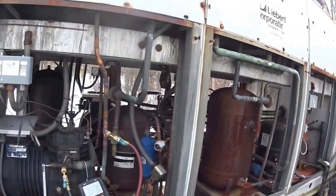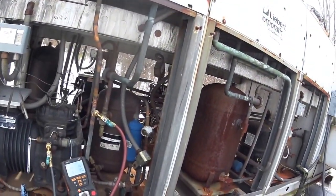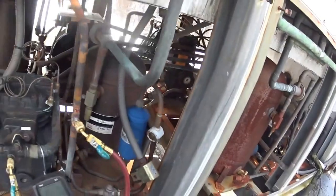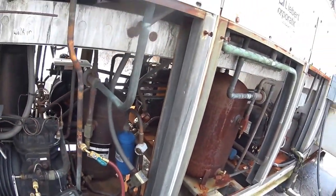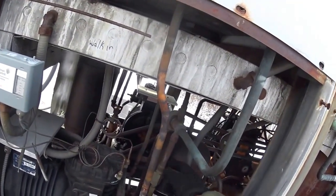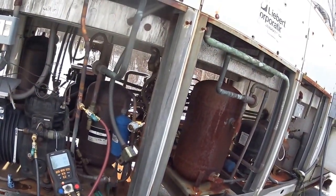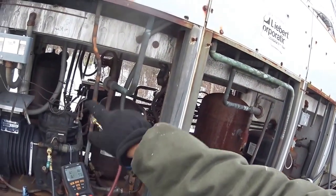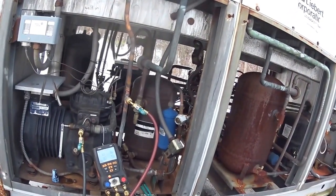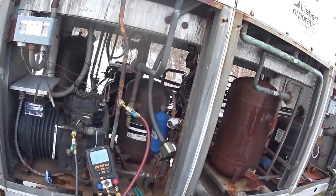We're filling up a little bit better now. I don't want to make it perfectly full, because you can literally overcharge it by a whole 24 pounds. I've taken a whole 24 pounds out of a system in early summertime because the technician put too much gas in it in the wintertime. What will happen if it's overcharged is the suction line will be frosting back to the compressor and my head pressures will be too high. When the pressure is low like that, you're going to bypass too much of the hot gas, taking away from the capacity of the system because you're not running the hot gas through the condenser, then the receiver, then down to the expansion valve.